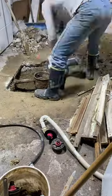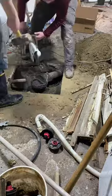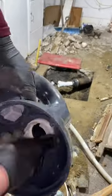At the start of day two is this clean out where the washer drains into it. Once again, we use the saw to remove the cast iron — being extremely careful not to break off more than what we want. We make sure the pipe's open at the sewer machine, then put this Fernco in hot water to make it a little bit more flexible before we install it on that four inch pipe.